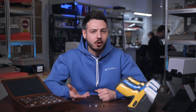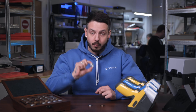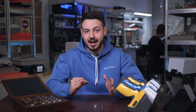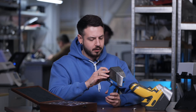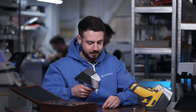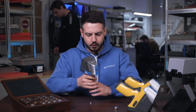Now let's move on to the practice part, where we'll run a small experiment with metal samples. We'll start with the 316 grade stainless steel, which is a standard alloy that the basic analyzer will definitely detect. All we need is the Prospector 3 base model. We choose the calibration for alloys without light elements, set the analysis duration for five seconds, and start the first analysis.